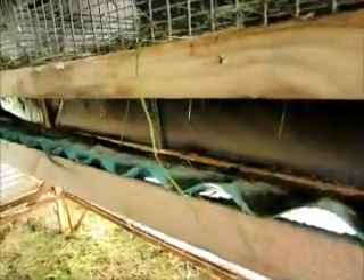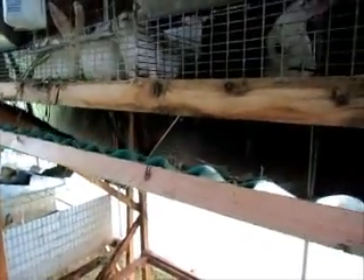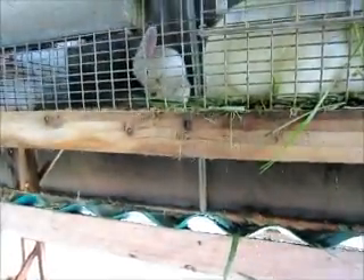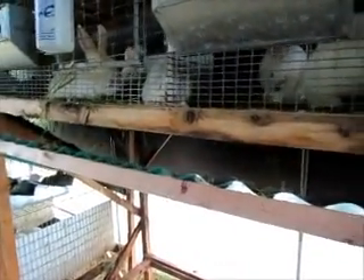This design looks like it'll work a whole lot better, and hopefully this quick video is helpful for you too. The one downside is you have to buy a 10-foot 2x4 and rip it down — I ripped it down to an inch and an eighth. You could go thicker, but then you need longer screws. Either way, you cut it down to eight foot six inches to make it fit the rack.